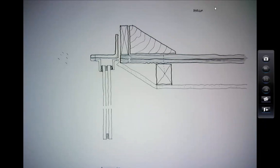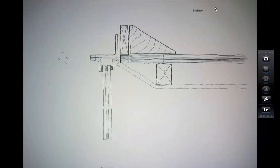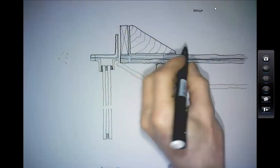The favoured roofing type we were using at BDP is a product called Derbigum — a hot melt system where sheets of asphalt material are stuck together with hot melted asphalt. The great benefit is it's self-sealing: if you put a nail through it, it actually closes up the hole afterwards. It's much more robust and sustainable — it can give you a roof that lasts 50 years without leaking, whereas a single ply membrane might give you 10 years. You can just Google Derbigum.